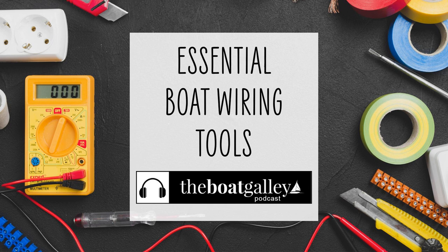The next thing is side cutters — also called wire cutters, or some people call them dykes. They're better for cutting the typical sizes of wire used on a boat than either the wire cutters that are part of strippers or crimpers, or large wire cutters designed for much larger wire. A six-inch pair of side cutters is the best size. Name brand ones tend to have better blades and an easier motion. Keep plenty of oil right in the mechanism where the two blades come together — it'll help a lot.